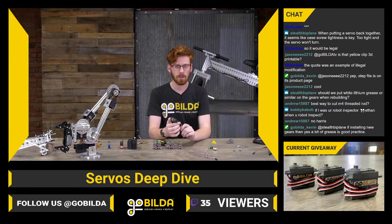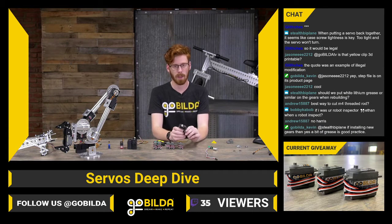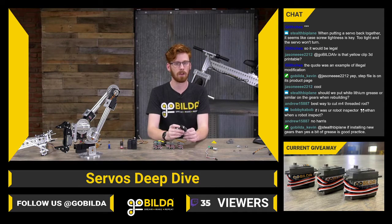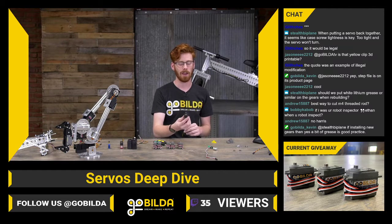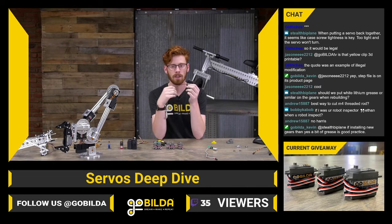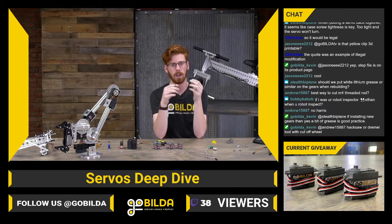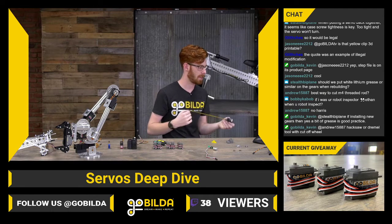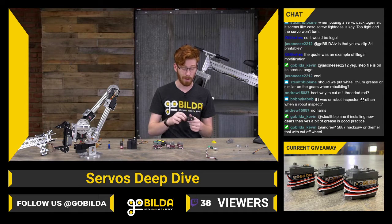And generally, most of the time, your coreless servos are going to be kind of that mid-range. They're not crazy expensive, but they're also not very affordable for most teams. A good example is the D9 series of Hitec servos, and most coreless servos I've interacted with have also had a pretty loud whine. Savox servos do this as well as Hitec ones, so it's pretty easy to tell that you have one of those.